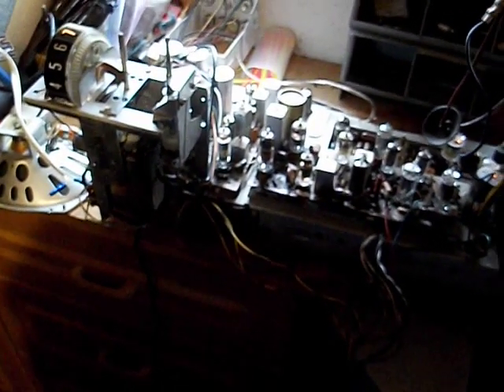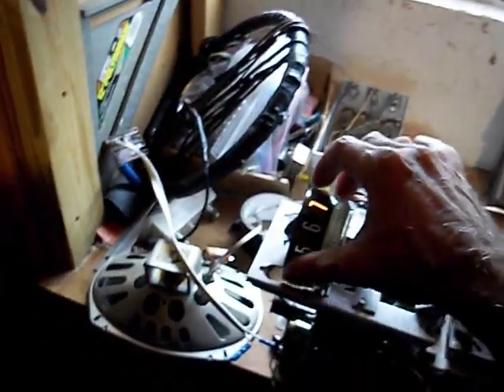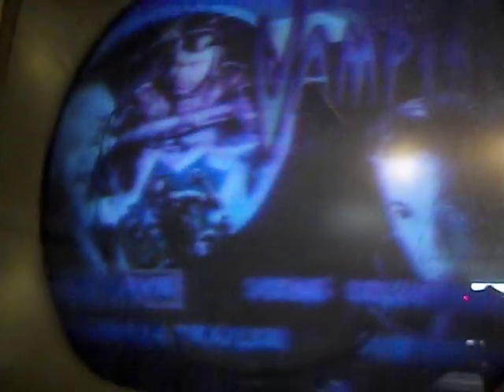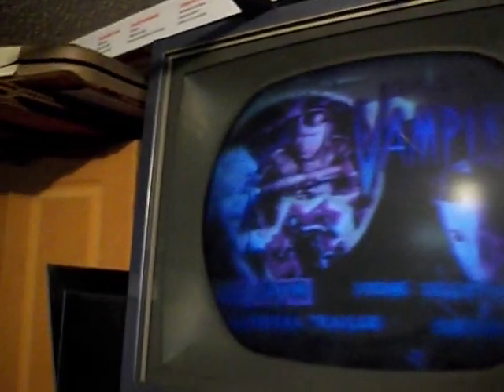The way I know the rejuvenator function seems to work pretty well is I went over to this test jig. I had been using one of these, which is a booster transformer. I decided to try this rejuvenator out on the test jig. This is the newly rejuvenated CRT. As you can see, this is in a well-lit garage and it's coming out pretty strong — a pretty decently bright picture considering the brightness of the room.